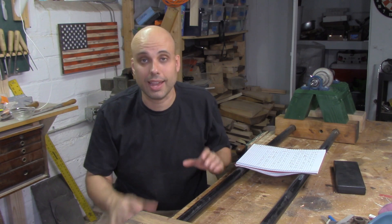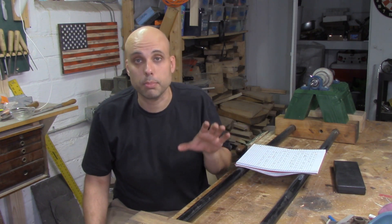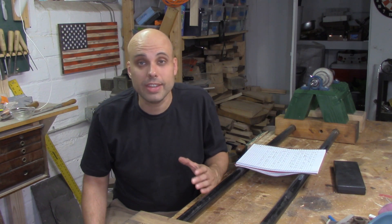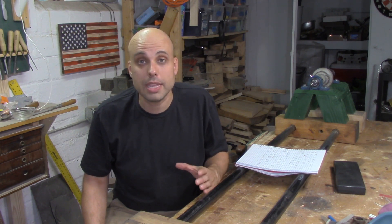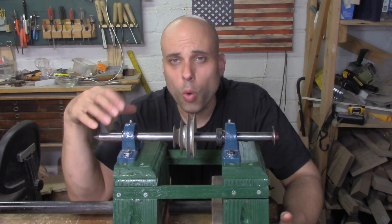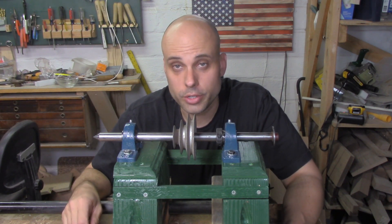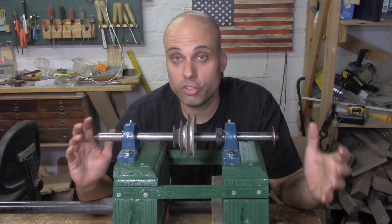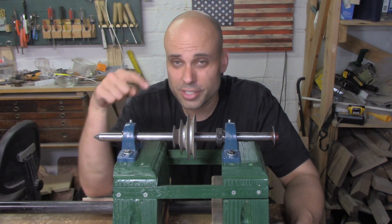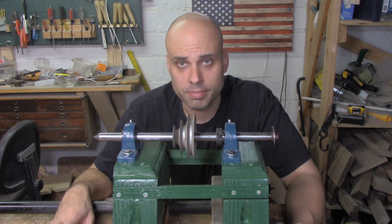I've done exactly that with this end block and I can definitely tell there's a difference. I found a couple of 34mm Forstner bits and I've linked to them in the description along with all the parts, tools, and materials I used in this build. If you want to follow along, you can start collecting the stuff right now. Also at the end of this series I'm going to have a very detailed set of plans available with all the measurements and a complete parts list with links for everything. One of the cool things about a lathe is it's one of the only machines that can help build itself. The next thing I need is a power transmission to let me shift speeds, and for that I need pulleys — a lot of pulleys. Step pulleys cost an absurd amount of money, so we're going to make them from scratch using this machine.